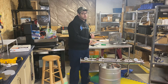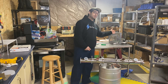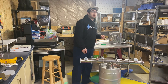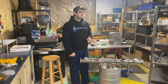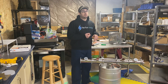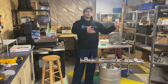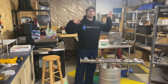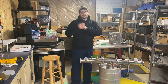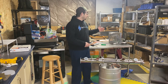In effect, however you generate your heat, you can take some of it to make electrical energy with your turbine, and the leftover can heat your home, bringing the whole system efficiency to 75 to 90 percent. That's based on a thermal battery at a set temperature — how much of that stored thermal energy can be converted to electrical energy. The vacuum steam system also works for radiant heating: you boil steam in a hot tank, send vacuum steam through lines in your home, and the latent heat of condensation heats the space. Steam holds a tremendous amount of energy in that form.